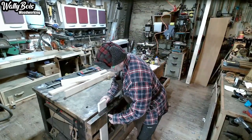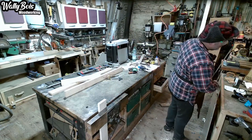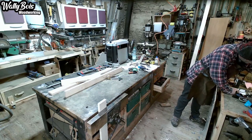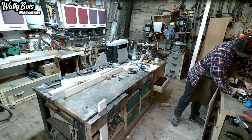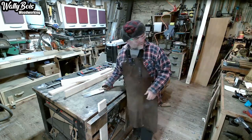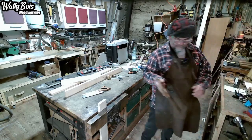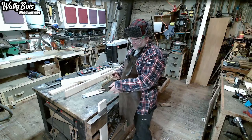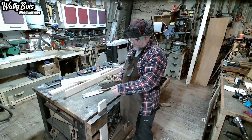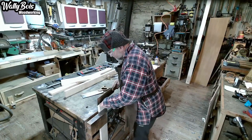We're going to cut it that way using a tenon saw. I need a larger tenon saw for that, because I need to be able to make sure I can cut all the way down. That one, no, that one will do. That's 150mm. It's a bit finer cut. So either that one, or I have another back saw here. I say back saw, they've got the brass back on them. So you see that one's much deeper. Might use this one actually, it's going to give me more control. And this one's a Tyzack. They're all self-sharpening, as in I sharpen them myself.